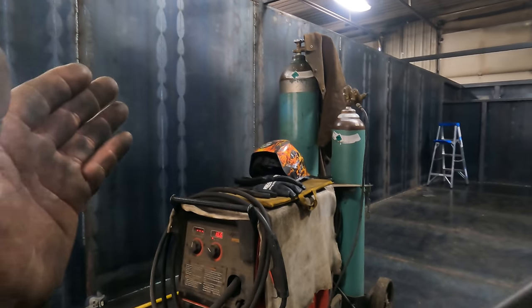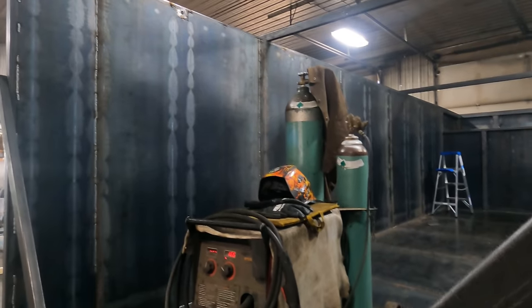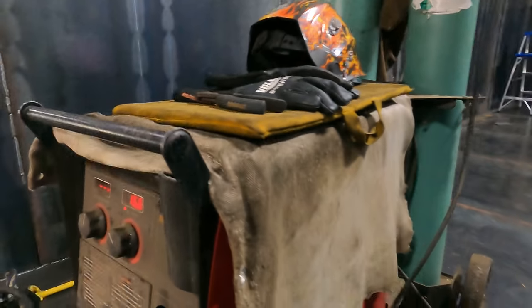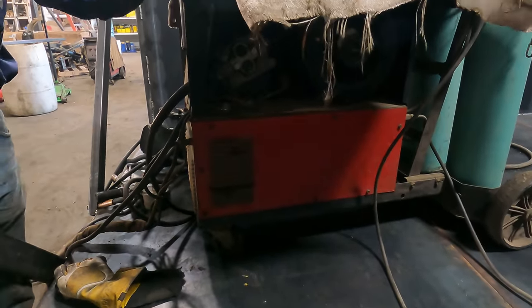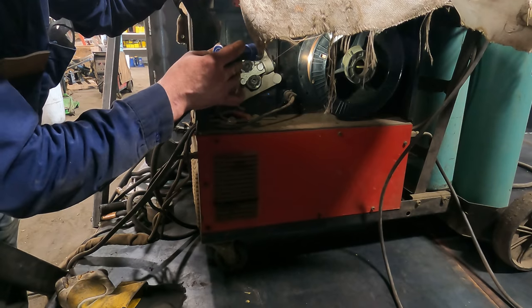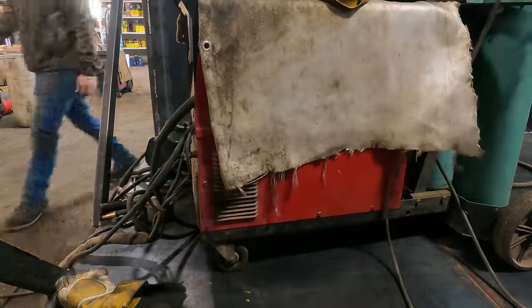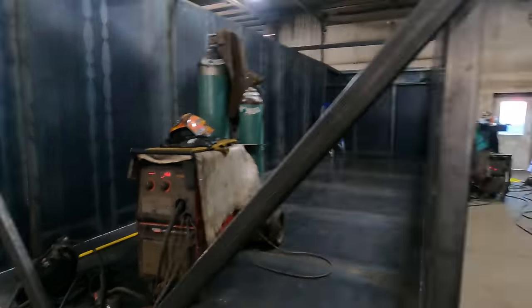Whereas the MIG process is pushing at 15 feet and you can run into a problem with it getting caught in the liner when it's trying to push it with the drive wheels, which are right there. You can't quite see it. Let me get this like this. We've got the drive wheels here and the large spool of wire, and it causes a problem inside the actual MIG welder, so it's easier to use the spool gun.